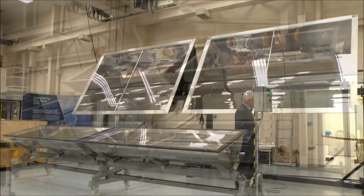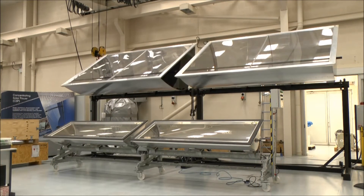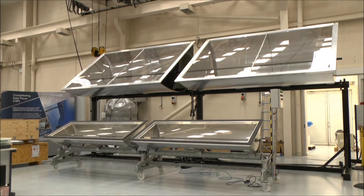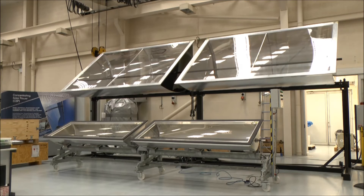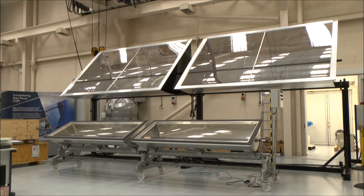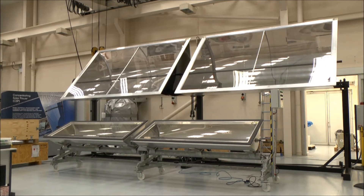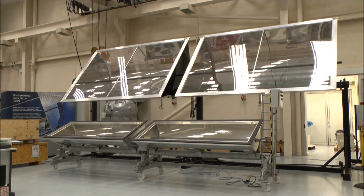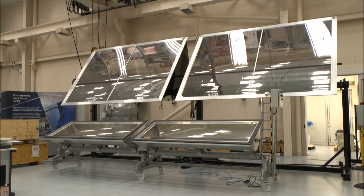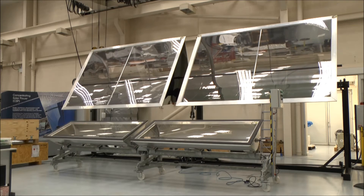The parabolas are constructed in stainless steel with a polycarbonate reflective lens and fitted at the focal point with one of Global CSP's heat exchange units. These units use an extruded alloy compartmentalised section fitted within a stainless steel tube and coated with a nano solution, again to maximise irradiation efficiency.